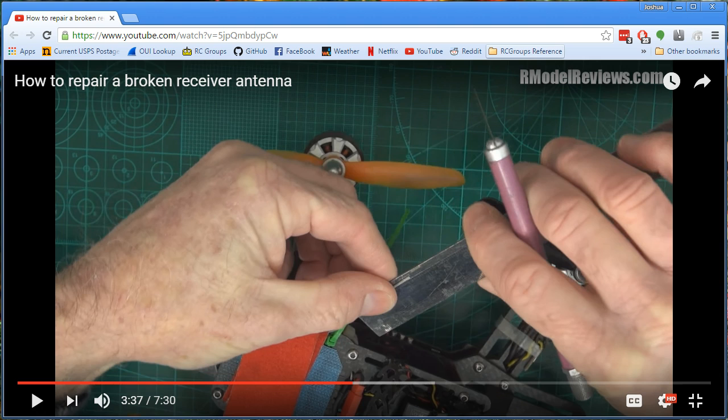And I find that that's really hard for me to get exactly right, especially if I screw up the cut a little bit or the insulation doesn't cut smoothly or whatever. So what I like to do when I'm doing these repairs is I will pull back the insulation to, let's say, 33 millimeters — I'll give myself a few extra millimeters of length.